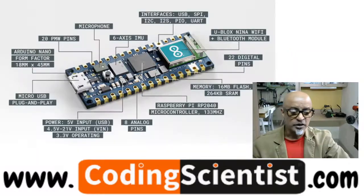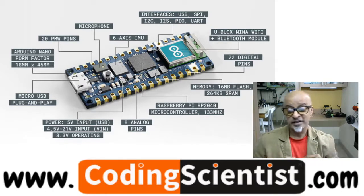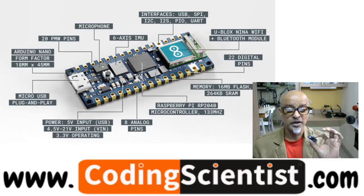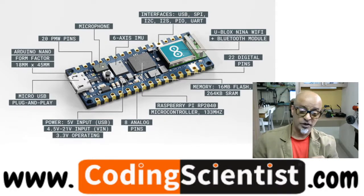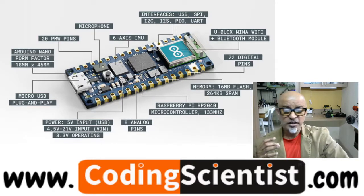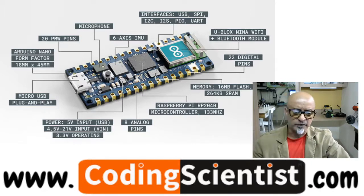From an architecture standpoint, it's basically a multi-radio wireless microcontroller module with an antenna pin. The u-blox Nina W102 radio module makes this the only connected RP2040 option available today. It gives full Wi-Fi 802.11 b/g/n connectivity, along with inbuilt Bluetooth and BLE version 4.2. In terms of sensor overload, packed into this tiny board are several very useful sensors — including a built-in microphone chip for sound activation, audio control, and even AI voice recognition projects.